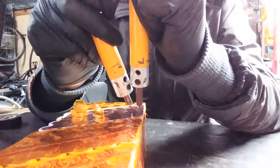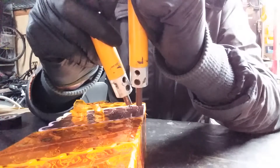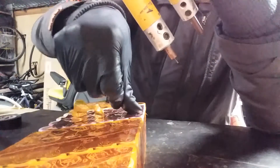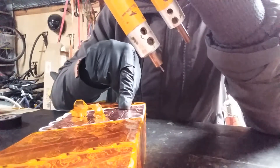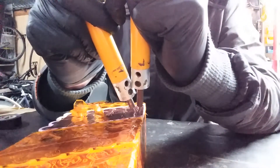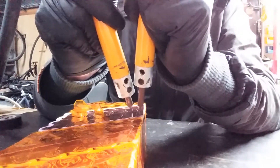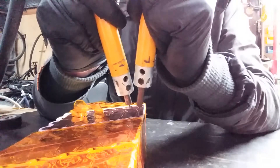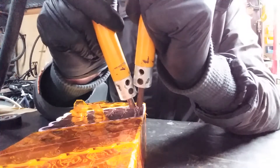I'm using these little magnets to hold the copper strip down while it's in place so things don't move around, and you can position things extremely accurately. The closer these strips are the better, because there's not much space on the positive ends, so they have to be pretty accurate. Not enough contact, or something dirty under there, and sometimes the spots get a bit hot.